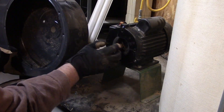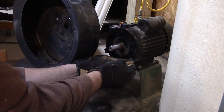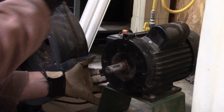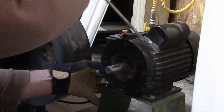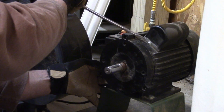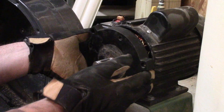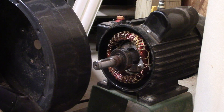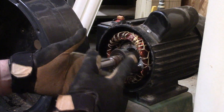The bearing is under here under this plate, so we'll take these three off. Alright, the five millimeter is feeling pretty good here. To get this off it can take some doing, but the first time I took this off it took a bit of effort — you just pry and pry and pry and you can eventually work it off. Then after a while you can just work it out. This is a good thing for the puller that the bearing decided to stay on the shaft.